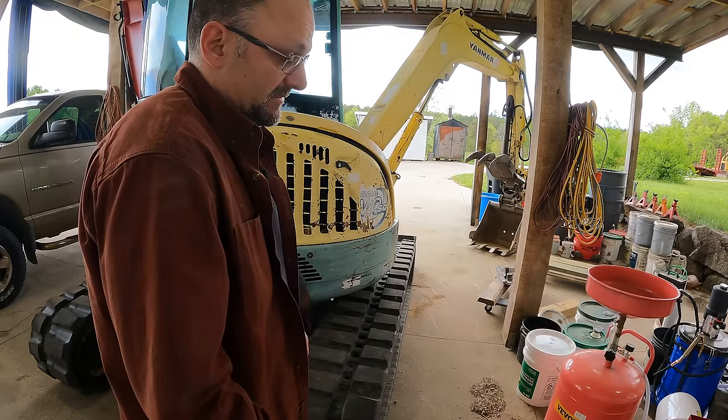Number two. You can see the two caps. Those are the hoses that I removed. They are now right here. So those will pressurize when I hit forward on the travel levers. This one is the left one. So let's get a gauge on there. We'll start her up and we're going to see what kind of bleed down we get.